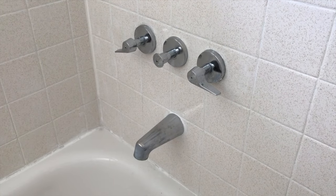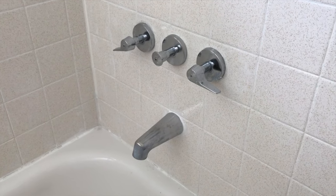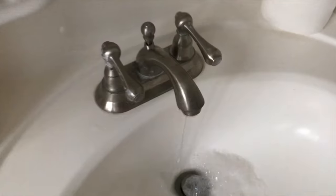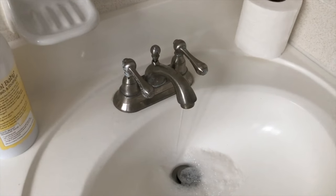The very next thing we need to do is go outside and turn off the water, cutting all water from coming inside the house. Turn it clockwise and make sure it's tight — that will turn off all the water. Back inside, open all faucets and allow all that water to drain out of the plumbing.